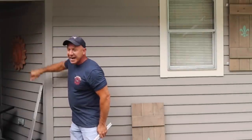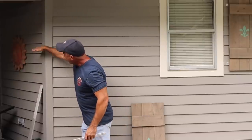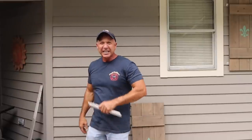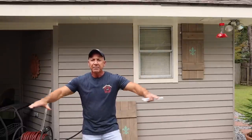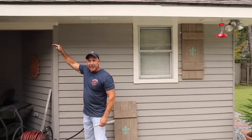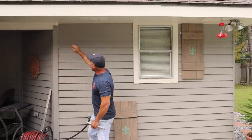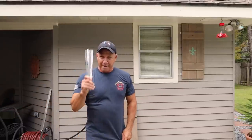I replaced a shutter on my last video. Look at this side over here — I didn't want to bring it to your attention on the last video because it was a short one, but look at how bad this is: the boards don't match. This board is here and the next one is about almost an inch above it. Make sure if you have siding that you're putting on a house, you start at the bottom — it has to be level. You work your way up so that when you come to the next side, it lines up too.